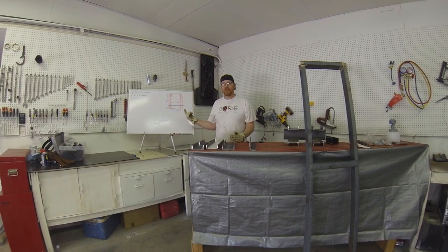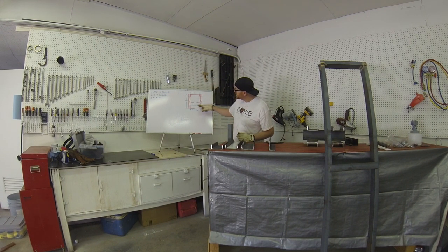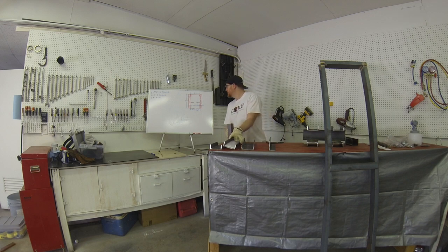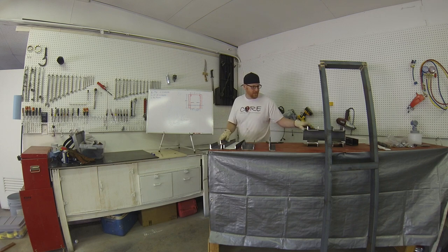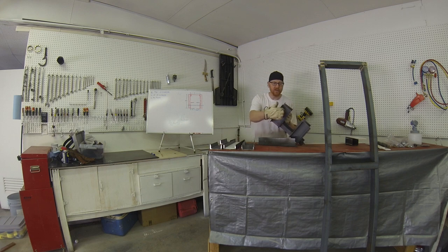Let's talk about the numbers involved. Our pillars ended up being seven and three-quarter inches tall and we left a quarter inch on top for good fillet. Our channel is four inches wide, so we matched that with our two 2x3 L-brackets here and here. We're going to center and drill where the pin goes through, making sure we have at least two times the edge distance in diameter from the edge — there's plenty of room to really center that hole and have good edge distance between our metal and the hole.